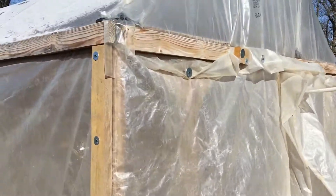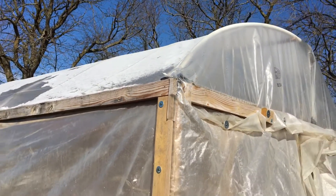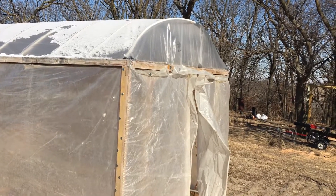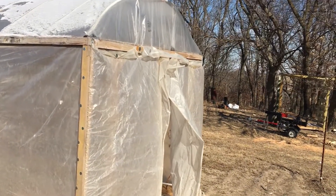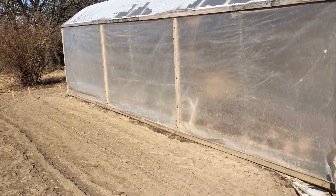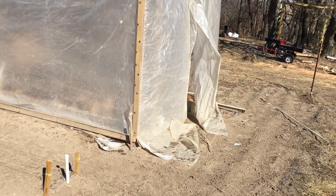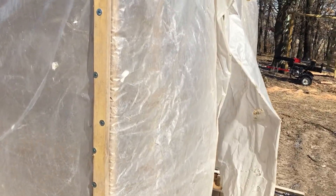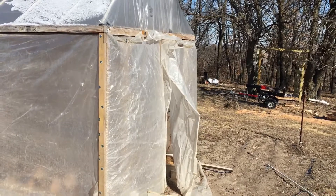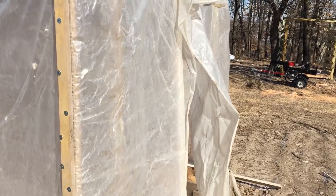At the corners you can see my patch. I would figure out something to cover the lumber corners better. I was in a rush to get this done because my help was coming to put the plastic on, and I didn't sand the corners or round them off to keep them from wearing on the plastic. When the 30-foot sail caught wind that first night — and that's exactly what it is, a big sail — it stressed all the corners badly and I had holes pretty quickly. I would take a cheap electric sander, smooth those corners down, and cover them with something to protect the greenhouse plastic.